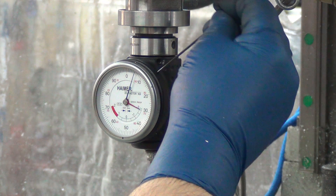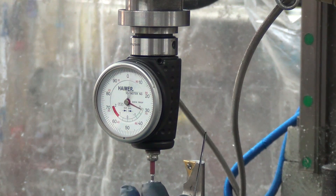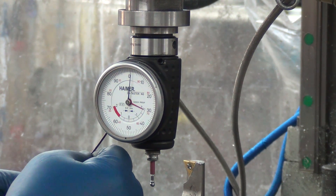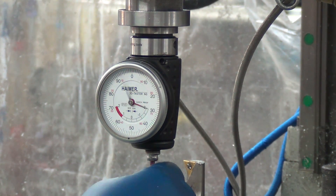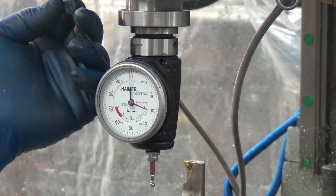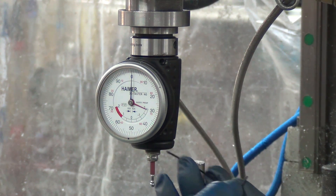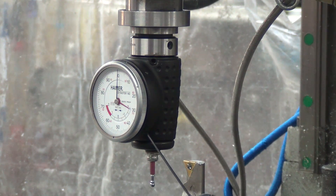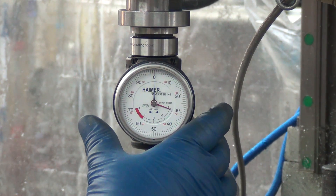Back to working nicely — each direction moves the needle no problem. The top screws move it to the right, the bottom ones move it to the left. I'll tighten the bottom one to move it left, make sure it still works, and move it just past center. Then I'll snug up the top ones — I don't want to tighten all the way but I do want some tension on each screw.